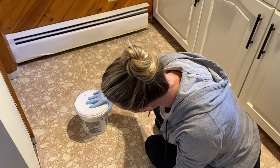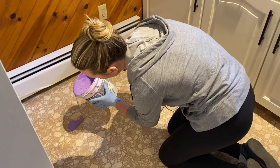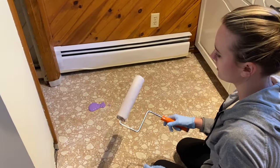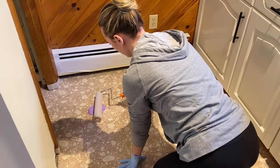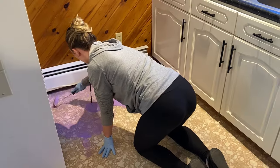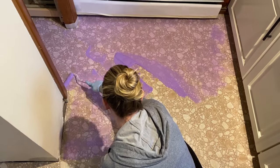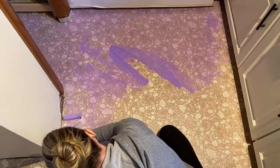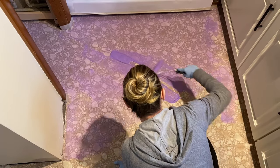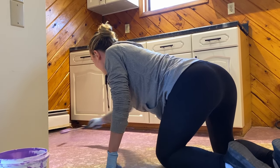So we have our Henry 647 adhesive. The great thing about this product is you don't even need to trowel it — just roll it with a paint roller. This adhesive is our absolute favorite due to how easy it is to apply with a roller. We also love how it is pigmented so you can make sure you hit every spot. If your adhesive recommends using a trowel, just be sure to get the correct size and shape trowel for your specific product — all that information should be listed on the back of the bucket. Since this Henry 647 requires such a thin rolled-on coat, it gets you up to 400 square feet per gallon. I will list the products we use down below.